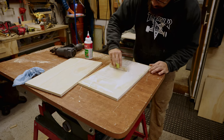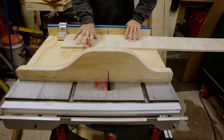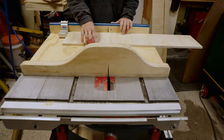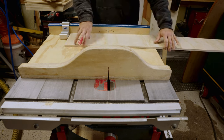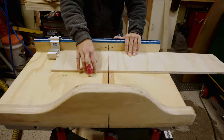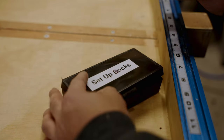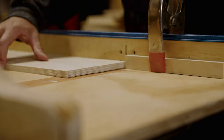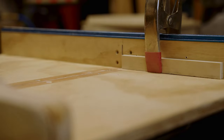For the flat Apple, I simply glued and clamped two pieces of material cut to the same dimension. I travel a lot with my gear and my space is limited, so I wanted Apple boxes that I could easily transport and that didn't take up a lot of room. The sliding door of this set was made by cutting a rabbet in the door and a small slot in the walls of the full Apple box. As these cuts were both cross-cuts, I used a homemade cross-cut sled. I set my blade to half of the material thickness using gauge blocks — in this case a quarter inch. To cut the rabbet on the door, I took small bites using the table saw up to my mark line. For the walls, I used the same blade height and cut a quarter-inch slot using the same process.